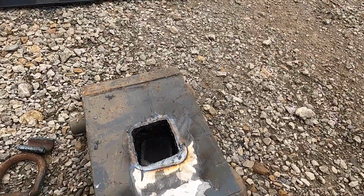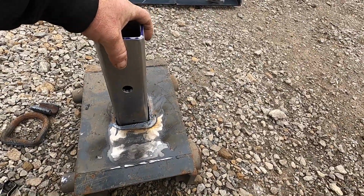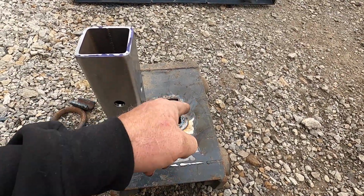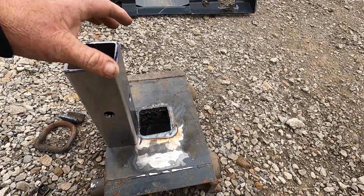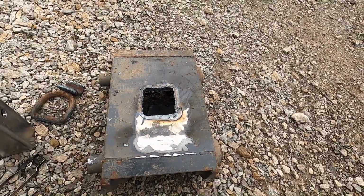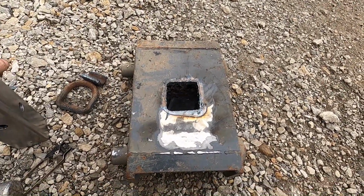Okay, well, got a little aggressive with that. This is my top. I have some fillet weld going on. I thought after the fact, I should have left the line. It is what it is. I started not to, and then I went back and took the line. I was like, oh, that'll give me a little bit, just in case of the kerf. And anyways, I've got about 1/4 inch to weld all the way around now.